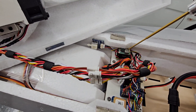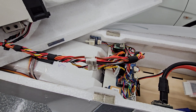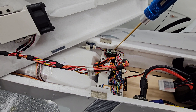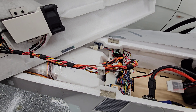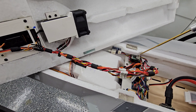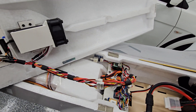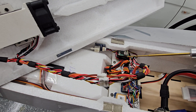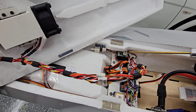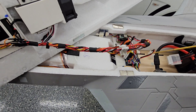This little guy right here is a voltage regulator. It's taking the voltage in from the LiPo battery and regulating it down to 12 volts — I think the amperage might be like 2 amps. The fan doesn't even pull an amp, and that's what this is running. This is strictly here to run the fan. Below that is just a capacitor — it's a 1,000 microfarad, I think a 36-volt capacitor — that just keeps the voltage stable on the onboard systems.